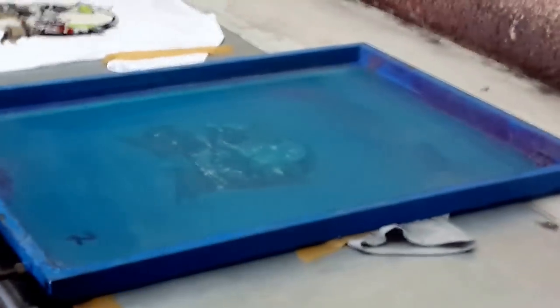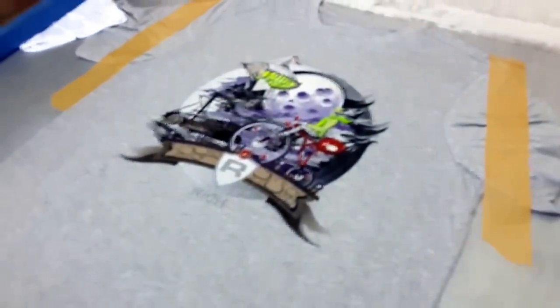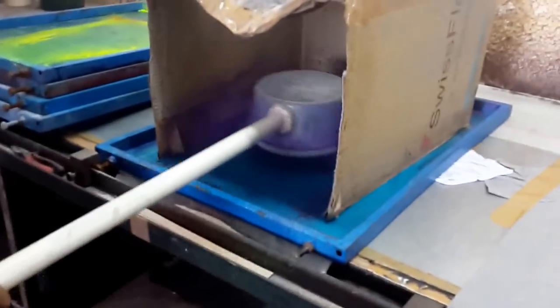The yellow appeared on the gray t-shirt. Now they are applying the sixth color — the yellow — to the gray t-shirt, and also to the white shirt. As you can see, this is the design. Now they are going to apply the seventh color — the purple-blue flock — and as you can see the purple component of the design appeared on the gray t-shirt. Now they are applying the purple flock powder to the white t-shirt again.